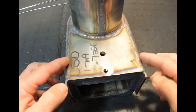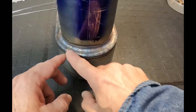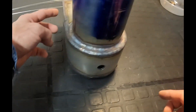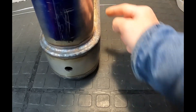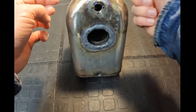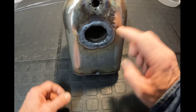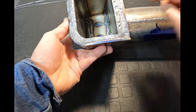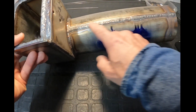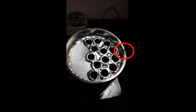For odd welds that are long and around the circumference, I divide into a number of runs — weld segments spaced around — then connect the dots, keeping it perfectly balanced. As you can see, this boiler hasn't moved and is exactly where it was. That same principle applies to all welds. I also divide the other seam welds similarly, and exactly the same for the foundation ring — a weld run, another weld run, then fill in the dots. I try to limit heat input at the end of a plate because that's typically where you get weld collapse.